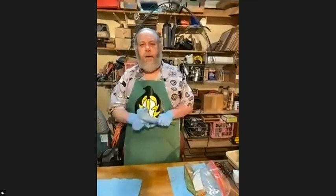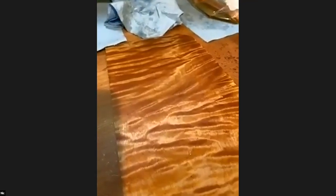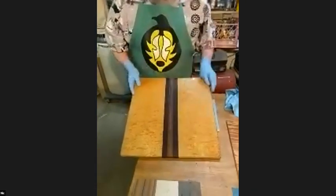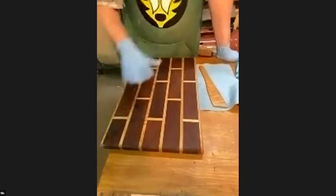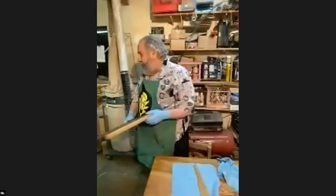Here's a piece of maple — raw on one side, and after soaking in oil on the other. Not only does the oil seal the wood, it also makes it look quite nice. I use this for cutting boards — here's one about 10 years old, still looking fine with nothing more than boiled linseed oil. For open-pore woods like mahogany I'll oil it for appearance, but then seal it with paraffin, which fills the pores and makes it easier to keep clean.